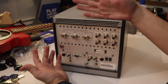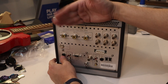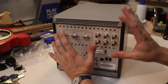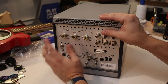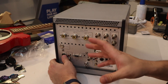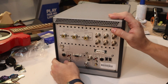Not a lot of amperage needed here because this radio only puts out 100 watts. It's intended for ham radios — ham radio, depending on your license, you can go into the thousand watt plus range, but you need the correct license for that full legal limit. This is meant to be kind of an exciter — you can definitely use it as is, or barefoot as it's referred to, or you can bump up and connect it to an amplifier. We're going to be running it barefoot today, dialing the power down a little bit to make it closer to some of the civilian radios.